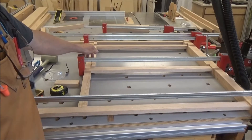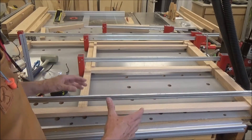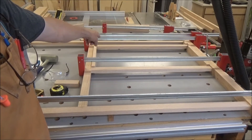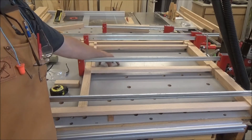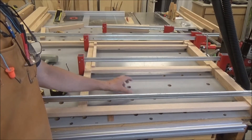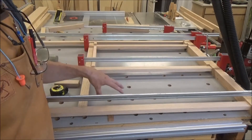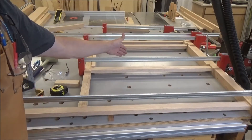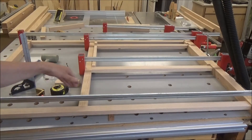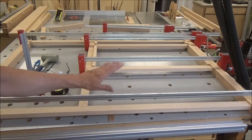I made some spacer boards that I'm going to use in the glue-up. I'll have to do this one side at a time, and that's going to keep my drawer spacing consistent and my wine rack opening consistent. This one is a sixteenth of an inch narrower than this one, but I don't care about that — it's open storage. The one I want to be consistent with is where the X's are going in. My opening there is a perfect 18 inches.